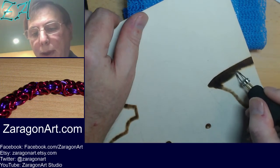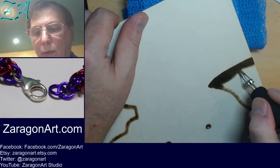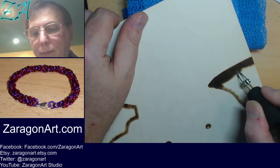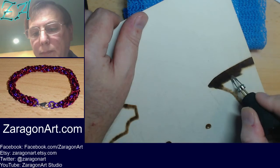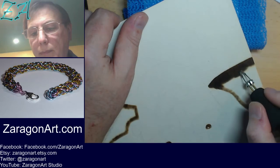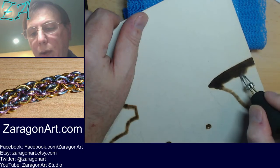As you heat up wood like this, it becomes rather wax-like, and then you get marks in the surface, which I hadn't realised I was getting, and I'm now trying to avoid. I thought I was avoiding them, but I wasn't. And avoiding the marks basically means not putting a lot of pressure on the wood. And the consequence of that is it doesn't transfer heat quite as easily.